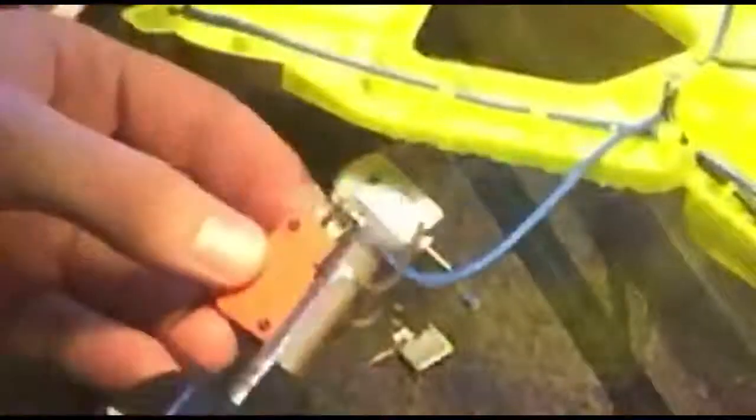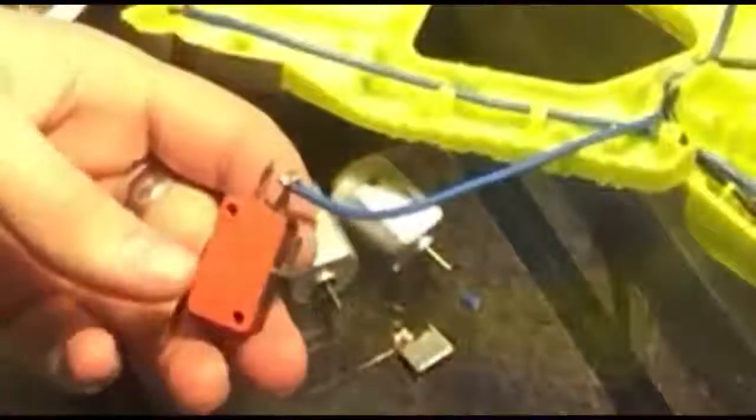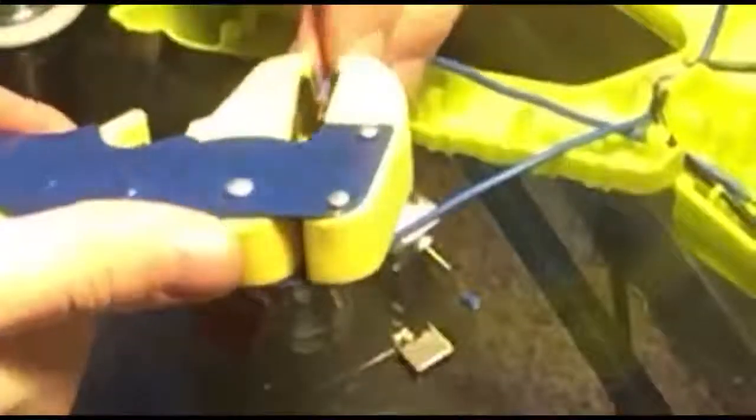And then, what I usually do, because I'm a cheapskate and I don't have heat shrink, is, if I'm worried about arcing or whatever, I will usually cover that in a blob of hot glue, because hot glue is non-conductive, and that is really useful information to know. Okay, so we're gonna lop off the end of that with my wire cutters that are over here. Okay, now I've sprayed dust of copper everywhere.